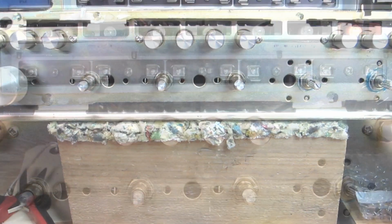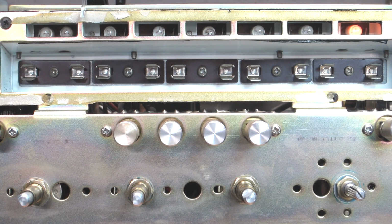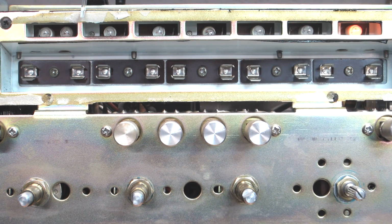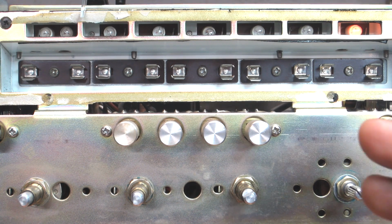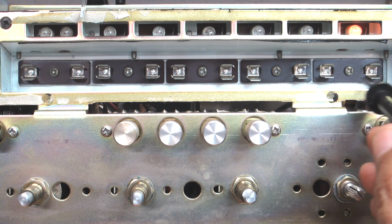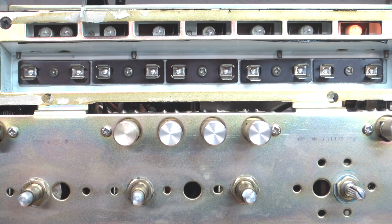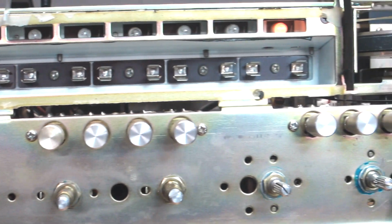So there you go. Another thing we can do is confirm that we have AC voltage in this case on the individual lamp sockets themselves. I'm not going to get into setting your meter up for that. Different meters have different settings, but just set it on AC voltage. Anyways, I'm just going to want to read across. These are the individual lamp sockets here. We have one here, one here, one here, one here, one here, total of 5. And all we're going to do is read across.